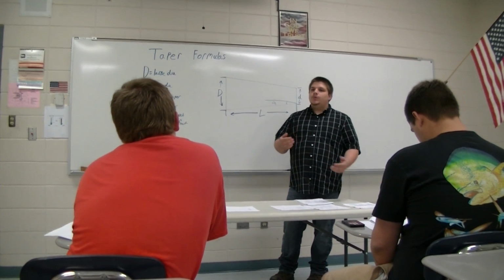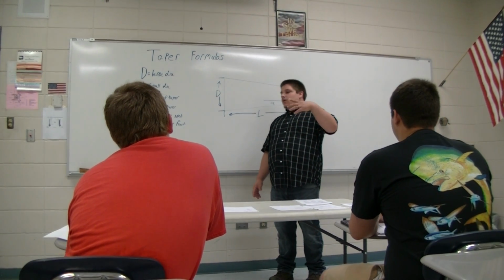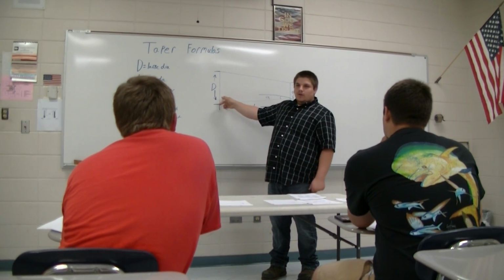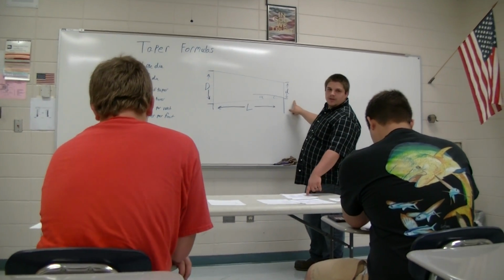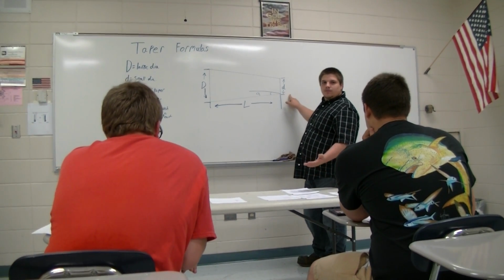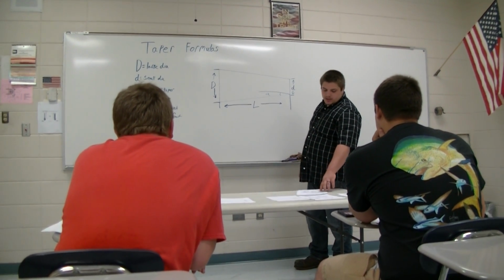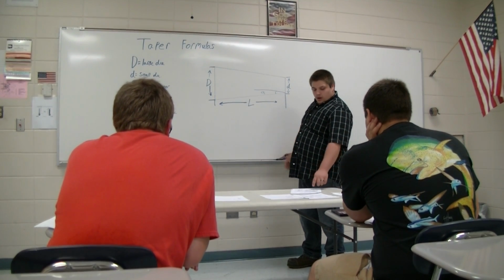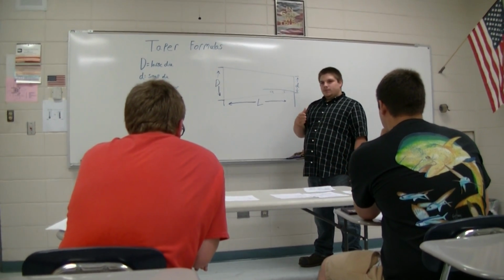You want to do that 2 times because you want half of the overall change. So say you have, on your big end, 3.375, and you have a foot's worth of taper. On your small end, it's 625 thousandths per foot, so it would be at 2.75, something like that. Well, that changes 625 thousandths. If you're going to offset your tailstock, you're not going to offset it the whole 625 thousandths. You're going to do half of that because you're cutting on one side of the part.